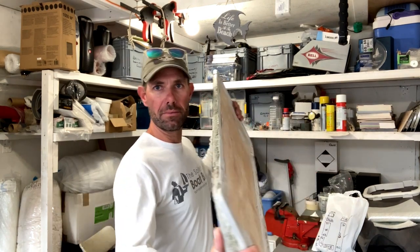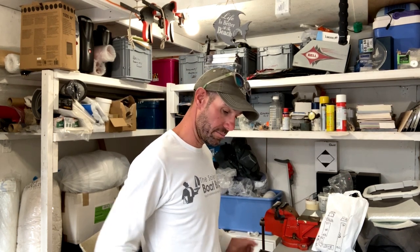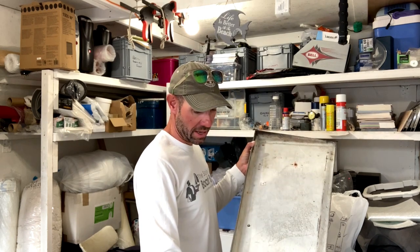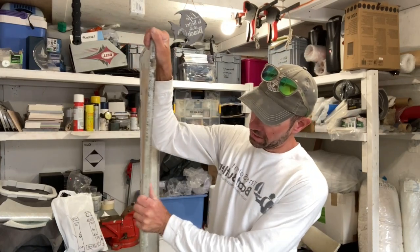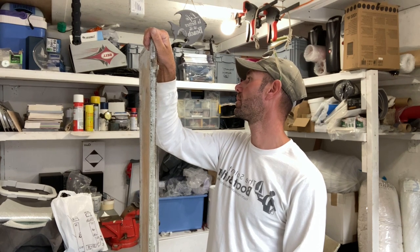Back in the workshop and I'm slightly embarrassed about the mess behind me. I'm here with the locker lids — they are very flexible so I need to do something about that. Last time I had a couple of these to repair off a slightly earlier Contessa, what I did was effectively put a couple of stringers into them. So I'm going to rip up some plywood on the table saw and put probably a couple of strips of 12mm plywood in there, then lay glass up over that stringer. I might also put a third hinge on it when I refit it once the decking is all done.